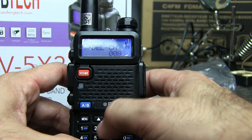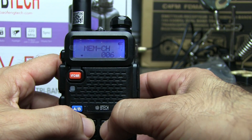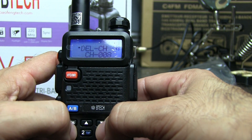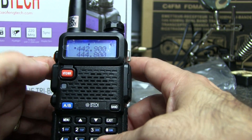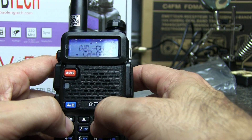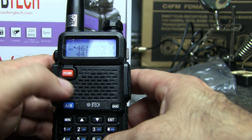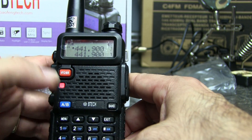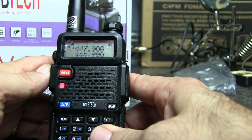You can go into the menu and set it to a specific channel. If the CH is not in front of it, that means the channel is blank. If the CH is in front of it, that means the channel is there. So you'll have to exit out and go up to delete channel, and then it takes away that CH. Make sure you're in frequency mode when you're doing this. It's still not saving the offset — it's saving everything else, the PL tone and the right frequency, but it's not saving the offset for some reason. So it may be kind of a bug in the Baofeng radio.